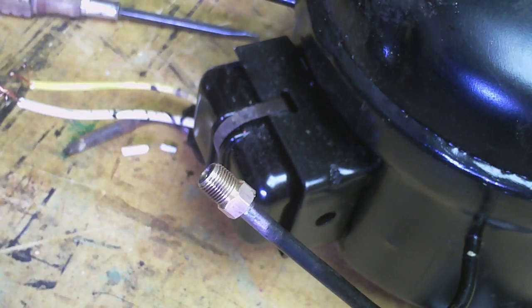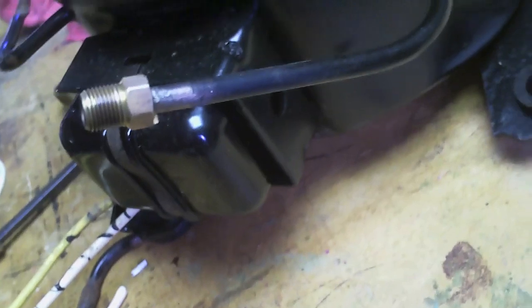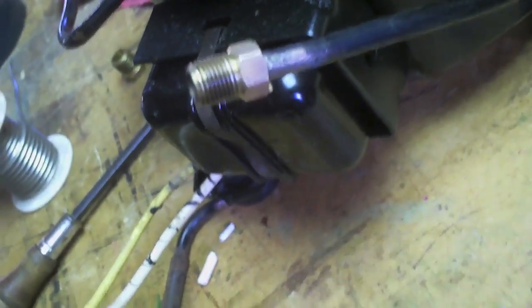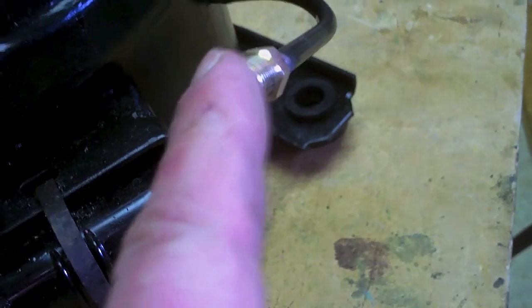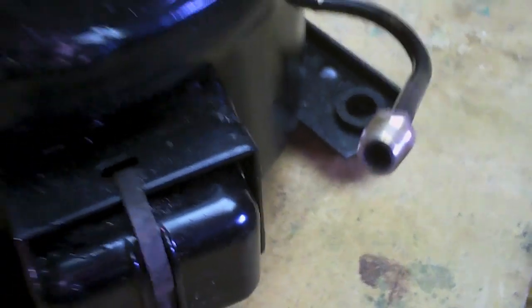Perfect. Let's see if I can get this where you can see it. You'll notice that I went to the back side. You'd think I would put it on the top side so that it would drip on down through. It ain't how it works. I put it on the back side and capillary action pulls it up. I can now see my ring of fresh solder right here. That tells me I got a dang good solder job on there. I believe it will be up to the task. Definitely up to the task.